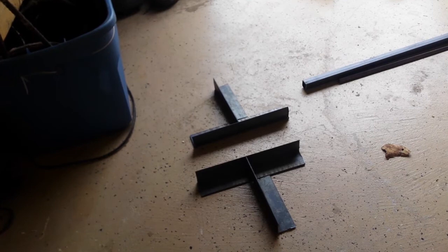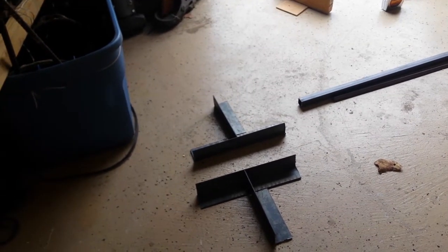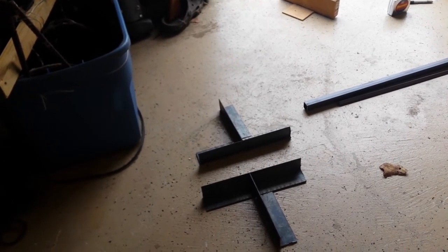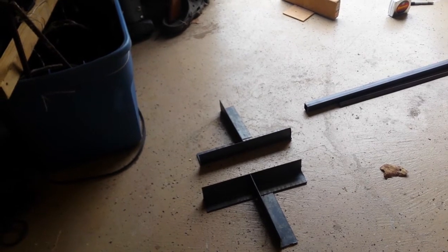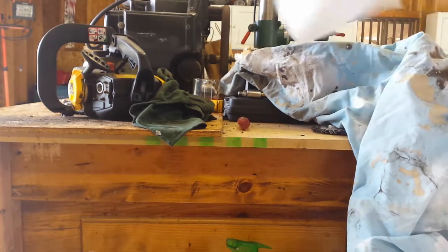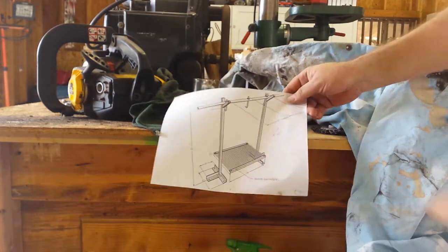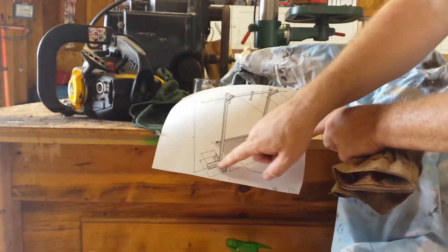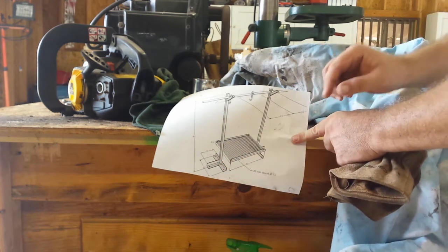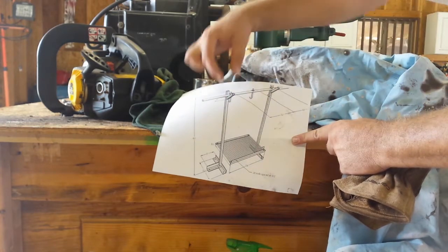There are the braces — we'll be drilling three holes in each of those when we're done. I went ahead and cut all these off; they needed to be notched and it was just easier to use the hand grinder for that. Here's the rough drawing I was telling you about, bringing it out so I can look at it. I got these notched out, and when I grind them they'll fit up nice — they're just a little bit big. Next is to cut these at four feet and these little pieces at six inches.